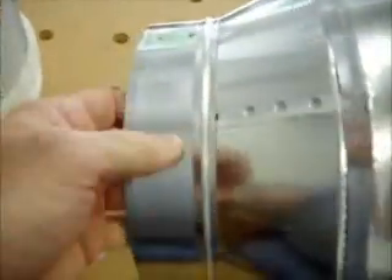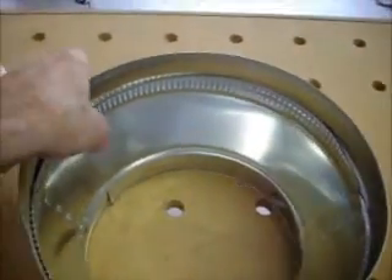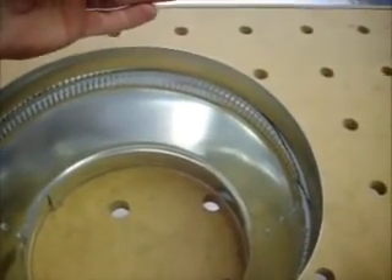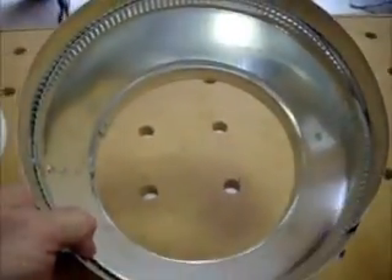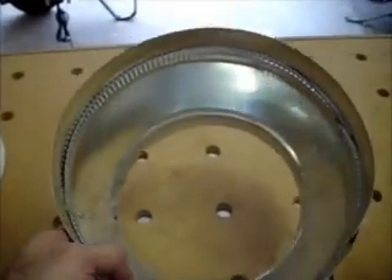What I'm planning on doing is cutting off the rings. I'll use the ten-inch ring on the eight-inch side, cut off whatever is excess, and then extend this angle here — this will give me my rigidness and a constant angle right in this area. I'll extend it out about six to eight inches for the funnel look, so I can have a worm extractor like you see on the commercial models. Let's see how this turns out.